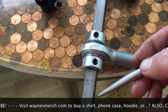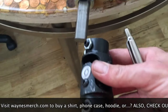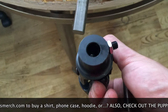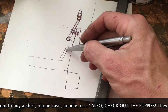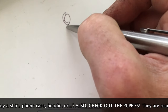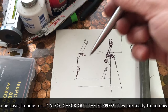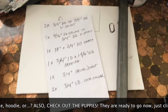The forums say you'll need a 2" piece — you'll have about 3" left so knock an inch off. Take that 2" piece and connect it between the 3/4" double-D to 3/4" double-D U-joint and the 3/4" double-D to 9/16" 26-spline adapter, which is what actually attaches to the Mustang 2 shaft. Because of the firewall-mount U-joint angling down, the heim joint holding it to the frame, and then the next U-joint kicking around the frame behind your exhaust header, it goes straight into the Mustang 2 rack.